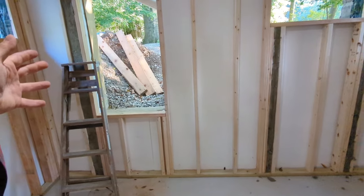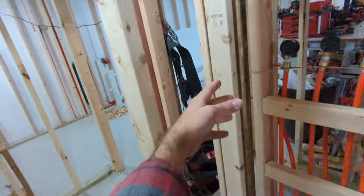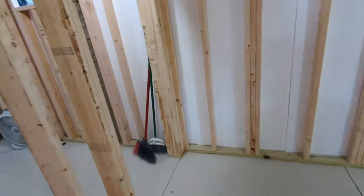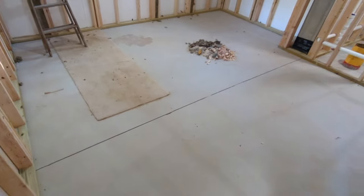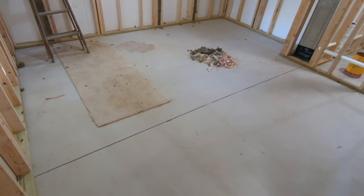I guess here we'll hop right into the wall and do at least this much, and we may swing over and keep going to some extent. Or however far we don't go there, we can come down here, go into the bathroom wall, hit that switch and the light circuit, and then take some other circuitry for the workshop outlets. The light switch for the workshop, I like a left-hand in-swing door, even if we don't put it in as part of this project, it isn't necessary to close out the permit. So that would make a switch right here for these lights.